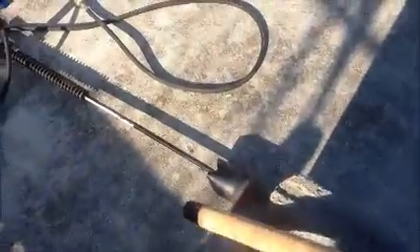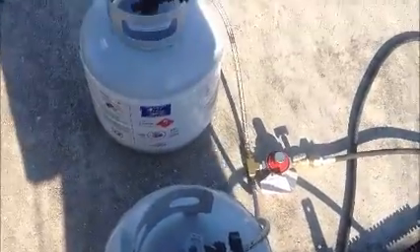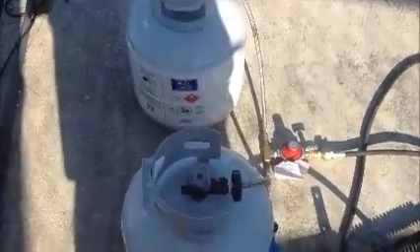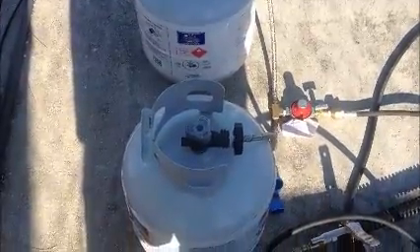I've got a weed burner from Home Depot — a 500,000 BTU weed burner, about $50. And I bought a high-pressure regulator that runs to two hoses so I can run two tanks and avoid any issues with freeze-up. A typical four-hour bisque uses less than two-thirds of one tank of gas, so I can easily get three bisque firings off of these two tanks.